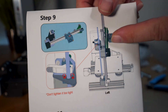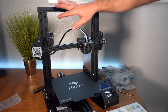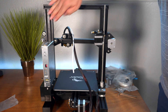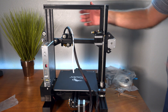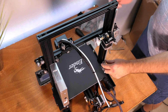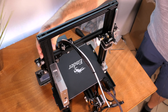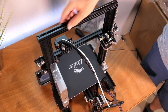Step nine is putting the whole assembly we just built on top of the rails. I accidentally missed recording this part, but here's what happened: put the main piece on top through the rails, making sure the rails are loose and the bolts underneath are not tight. There's a little bushing with a thread that goes into the t-rod — spin it so it grabs and pulls down. The important part is that the two main channel beams are loose. Then install the top channel.